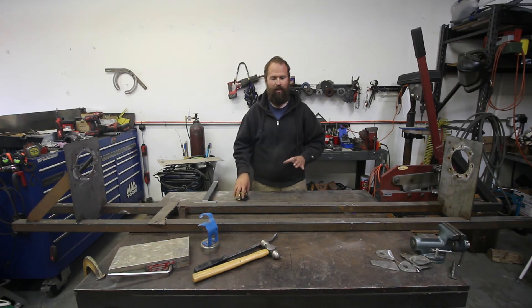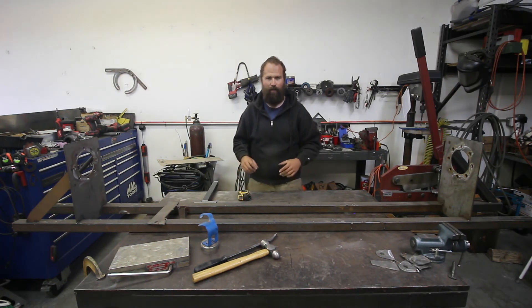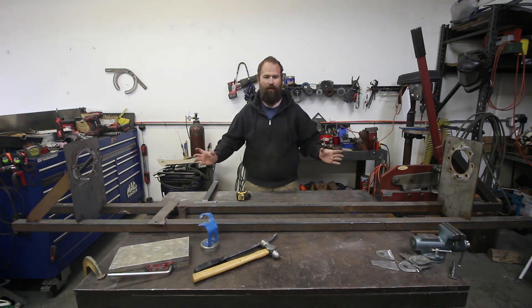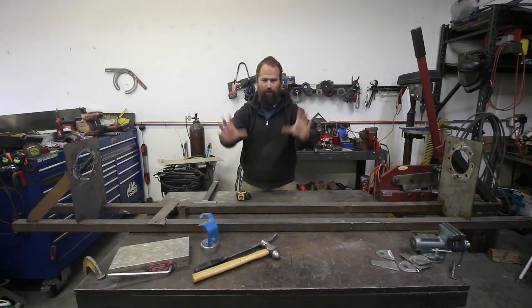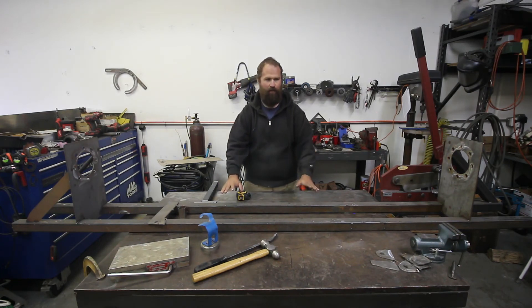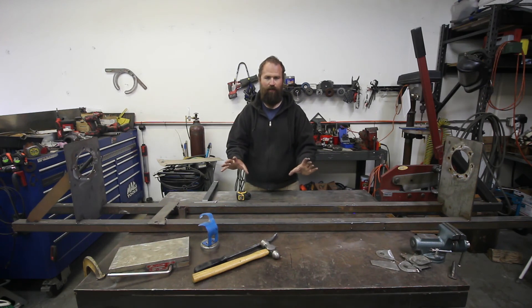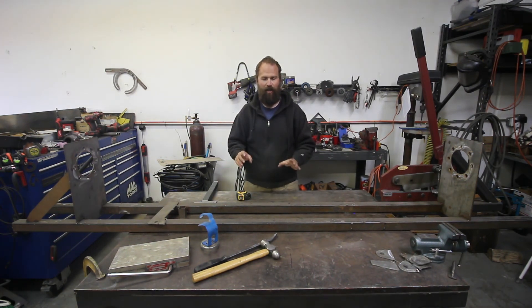That's what this YouTube channel is about — teaching tips and tricks I've learned over the years to help someone working in their garage building their first pre-runner or working on a lowrider. A lot of this stuff is just general automotive fabrication. A fixture can work on a lowered car, a lifted truck, a beam swap, an arm swap. I even did a Mustang 2 front end on a 50s Buick — built a fixture to bolt it all at ride height, tack welded the subframe with it all cambered, and was able to put it under the Buick and lift it into line with the frame.